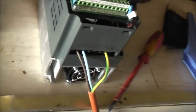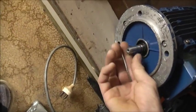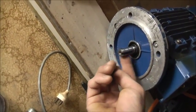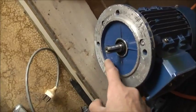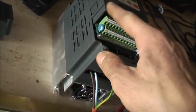We'll wire this motor back up and show you a demonstration. It's actually a lot smoother on this drive. It's a very smooth, quiet running motor, but the rotor and the shaft get a bit hot. The frequency induces a bit too much heat in that shaft because I haven't programmed the parameters in this drive at all. Once I set this motor up on this drive properly, that should take care of the rotor heating problem.